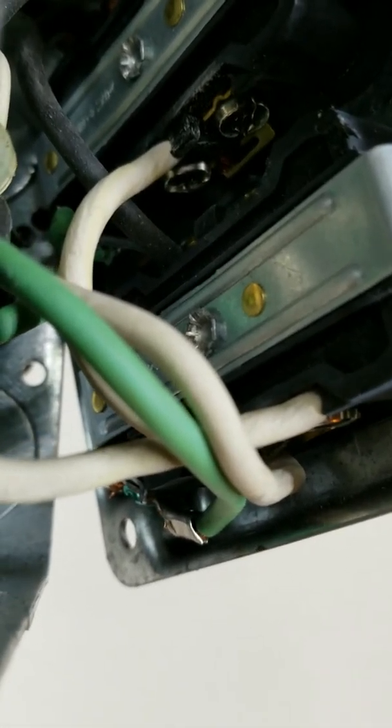We're going from one side of the plug to the other — these are parallel wires on the plug — and then from that plug to one side of the power con and to the other side. That way I've got a straight through from one power con to the other without any resistance, going up and around one of those screws. The other wire is just a jumper to the other side, and I do the same thing with the black. One wire stripped in the middle goes to the power con on one side and the power con on the other.